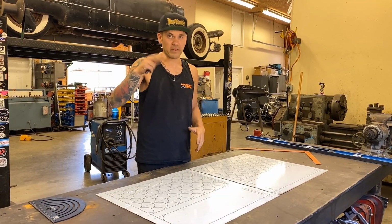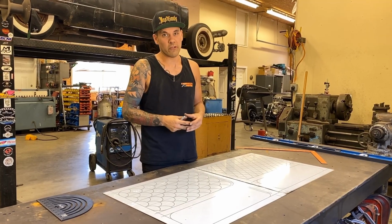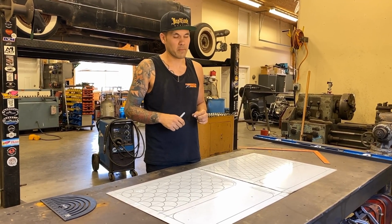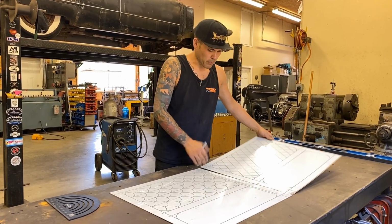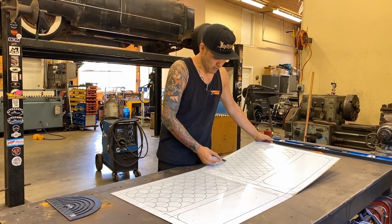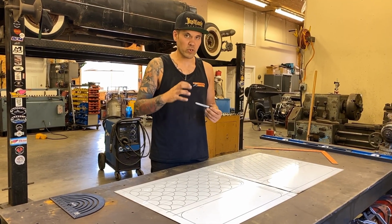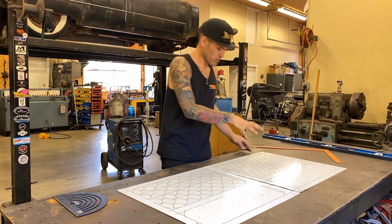It came with tipping dies and some other ones, but I mostly use the poly lower wheel and a sharpened tipping die. I actually sharpened the one that came in the kit to a dull sharpness. You don't want to cut the metal or anything, but we're going to press the sharp line on all of our Sharpie lines, and that lower die, because it's squishy, is going to puff up around our sharp line. We're going to do this first.